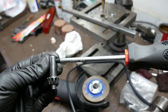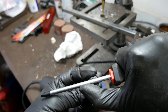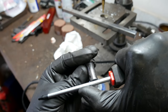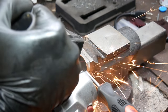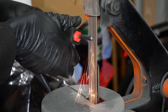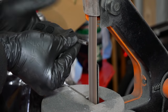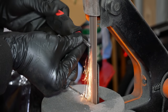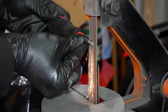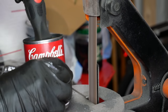I would probably never use it anyway, so I don't think we're really losing anything of value even if I do manage to break it. The first step once we've gotten a feel for how long it should be is to cut the screwdriver to that length. Then we'll take it over to the belt sander and remove material until it seems like a good fit inside the chuck key head. We have to be careful not to get the steel too hot since it could melt the inside of the plastic handle, so we'll have to go slow and keep dipping it in our high-tech cooling liquid.